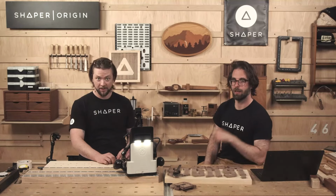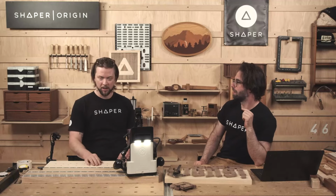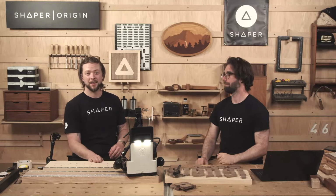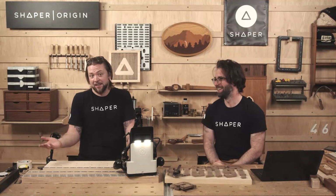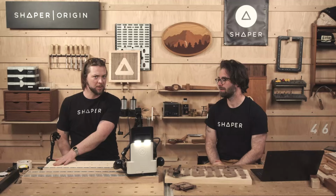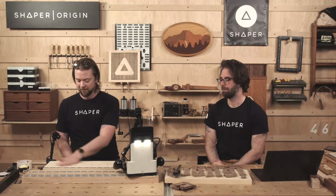Where did we end up? We got him on the Secret Service mics. Okay. 3 minutes, 13 seconds. You know, if you got a lot of holes to helix, good podcast on your headphones. How many holes are you helixing, man? Never know. But definitely faster and more accurate than the drill press, I would say. If you got a 32 millimeter hole system on a cabinet or something, oh yeah, let it rip.